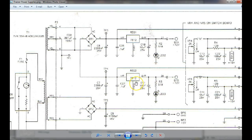This goes down to a 7912. A 7912 is a fixed 12-volt regulator. This goes up to a 7812. These are very popular. The 7800 series are positive regulators, and the 7900 series are negative regulators. They're exactly the same, except one is designed for a positive power supply and one is designed for a negative power supply.